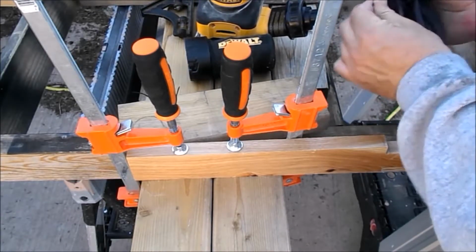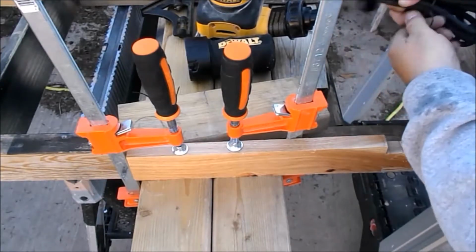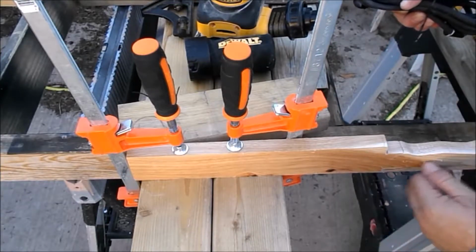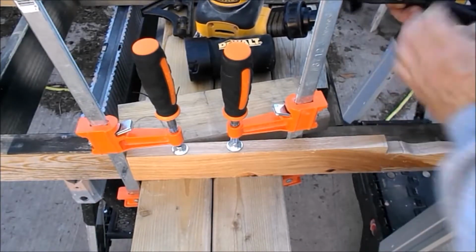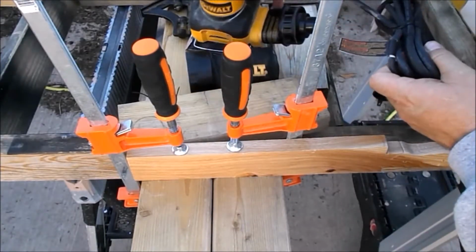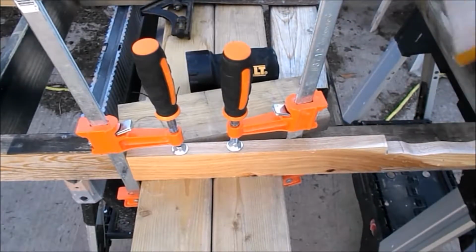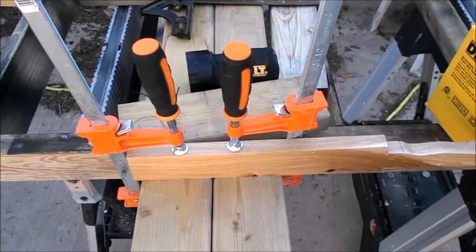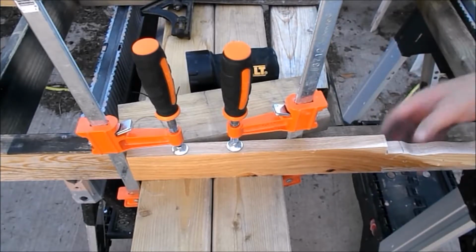But I did get a lot of information, and one of the pieces of information that I forgot was they said when you drill it that you need to put tape over it so you don't burn out like this did. However, I think I'm going to need to enlarge my holes a little bit, so I'm not too concerned. And one of the things I read about doing, I'm planning to peen the pins, not do epoxy. This is a kitchen knife. It's not something that I'm looking to sell. It's just something for my mom's kitchen.